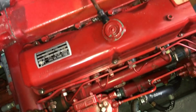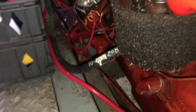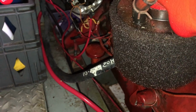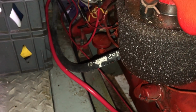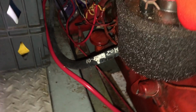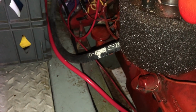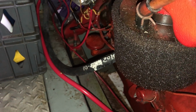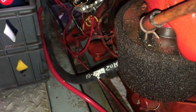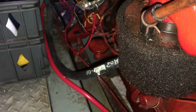And then looking at the valve cover here, there's an air crankcase breather hose that terminates at the air intake filter, which is port side. Mine's got some dog hair on it. We run in a low dust marine environment, so I've actually never cleaned that filter. I'll just visually inspect it for any problems. And it stays fairly oily at all times from the breather hose. I gotta be careful if I'm down there with pants on, and I don't want to accidentally brush against that filter.